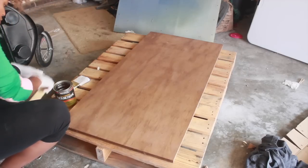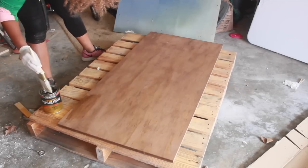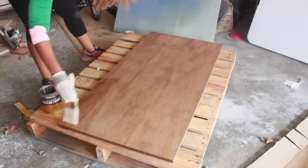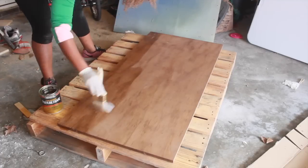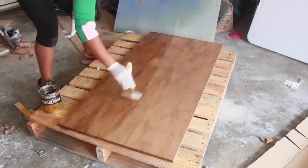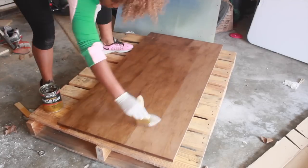You're going to open up your polyurethane and mix it up to get everything that's settled to the bottom all the way to the top. You're going to use the same process after the stain has dried — I think it's about four hours the stain needs to dry — and then you put your poly on. This is when you really start to see a finished product, like something you saw in a magazine or at the store. This is the exact process I did with my vanity — I'll link my vanity post in this video.